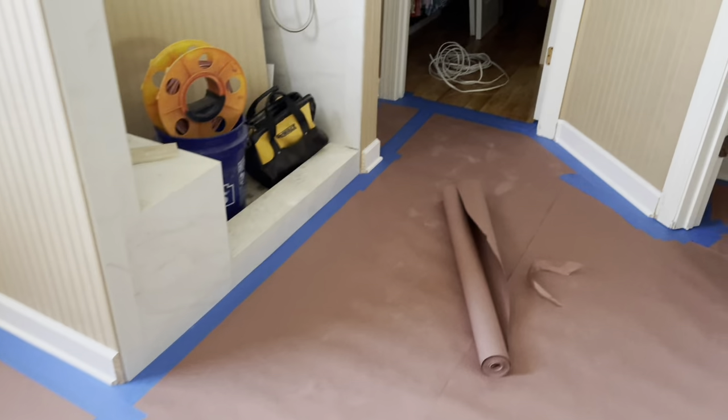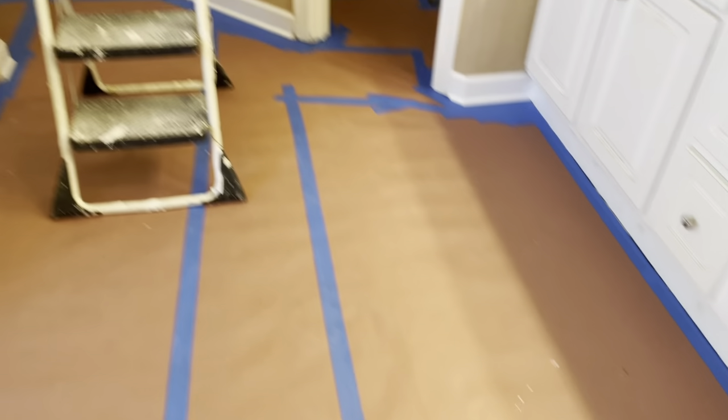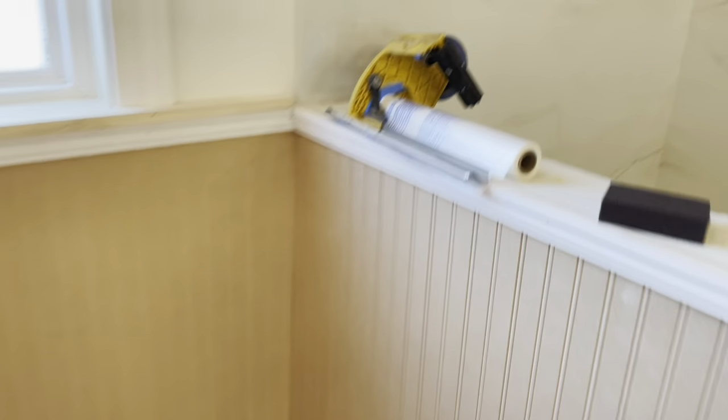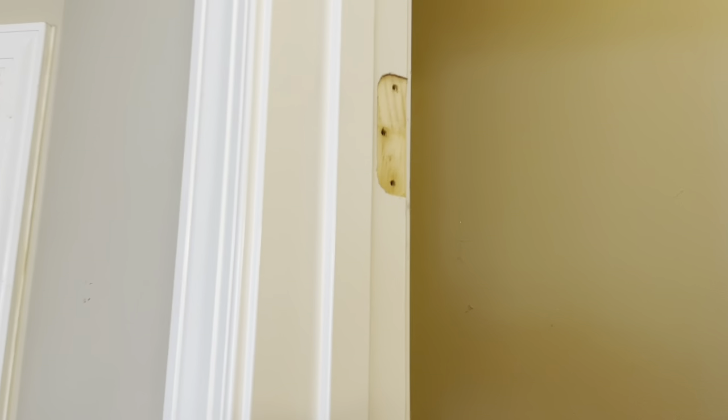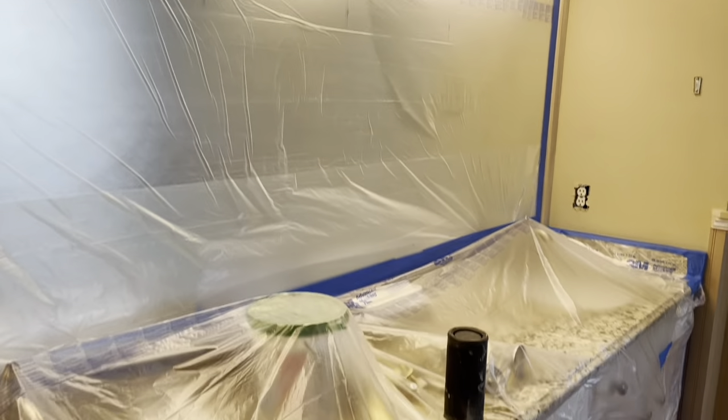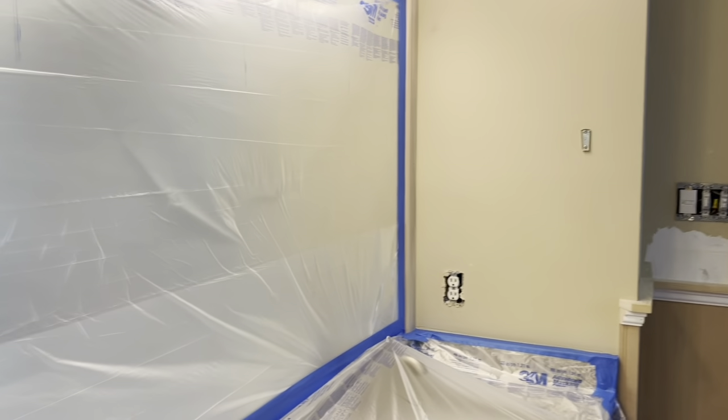We're going to go through step by step through the painting process. The first thing we want to do is cover all of our floors with red rosin paper. Then we'll bust out this masking gun — cheapest place to get this is Home Depot. If you get it from Sherwin-Williams you'll pay about 75 bucks for the blade and gun itself. We're going to cover the windows and the new tile in the shower with plastic. Once we get everything masked — I took all the hinges off, covered the doorknobs, floors, even covered this mirror and vanity — because we're going to be spraying oil-based finish paint and it gets real messy. It sticks to everything and stays wet for a long time, so it's just best to cover everything.